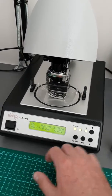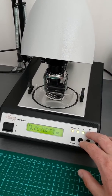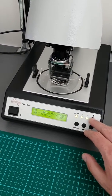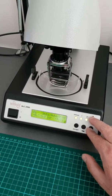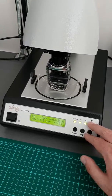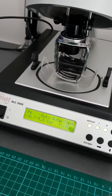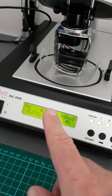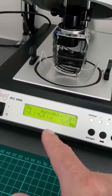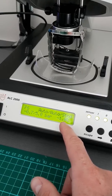The way these work is extremely simple — they have several different pre-programmed programs already in there. You can put in custom programs but I don't really see a need to. The most commonly used ones will be the 100-meter diver and this one here, which is just basically a standard type test for a normal waterproof wristwatch. The minus one percent is just the amount of tolerance that it allows on the test.